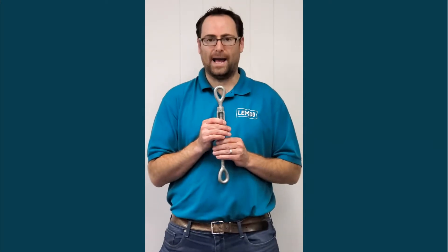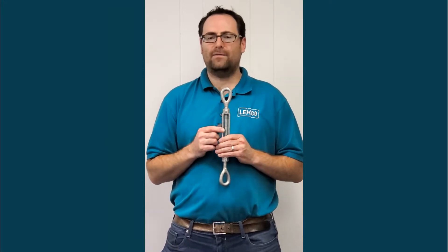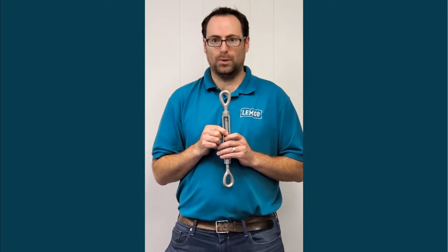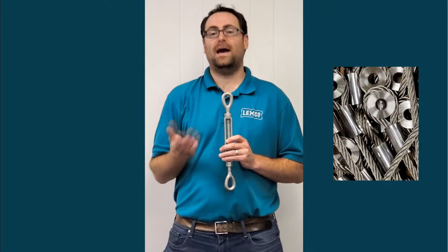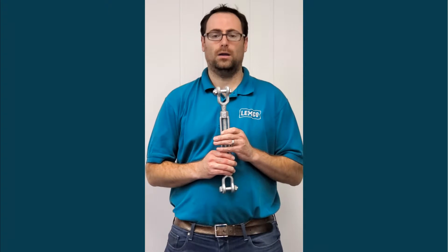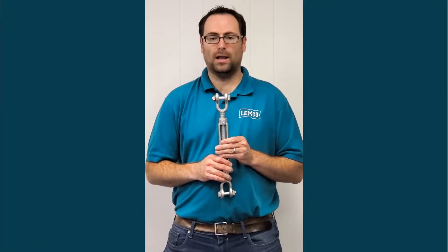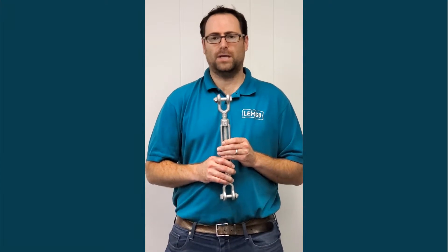If you go with an eye, you're going to have the safety that it won't detach by accident. But you may have a thimble on your wire rope loop, and then you have to deal with the thimble. So you can go with the jaw. The jaw gives you the option of keeping the pin there and removing it only as needed, but it's secured — it won't fall out. The eyes and jaws I find to be the most popular for their security reasons.